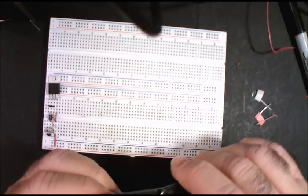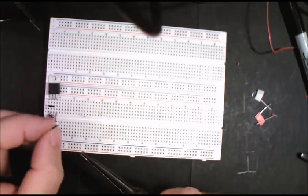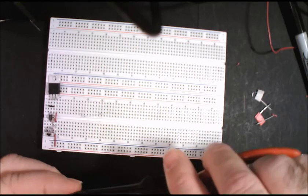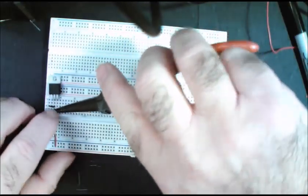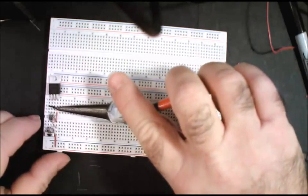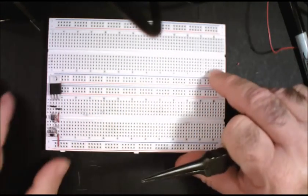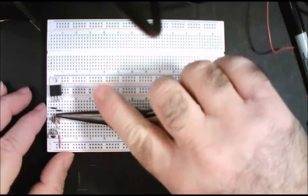Make sure you strip these 3/8 of an inch long. If they're not 3/8 of an inch, you will not have a deep enough connection. 3/8 of an inch means you get a good connection that goes all the way into the body of the board and gives you a nice, healthy connection. Work with needle nose pliers if you have big fingers. For those of you who are color blind, come see me — I have a voltmeter so you can read the values on the resistors. We're going from G3 to G5, and now we have power moving into the 5-volt zone.